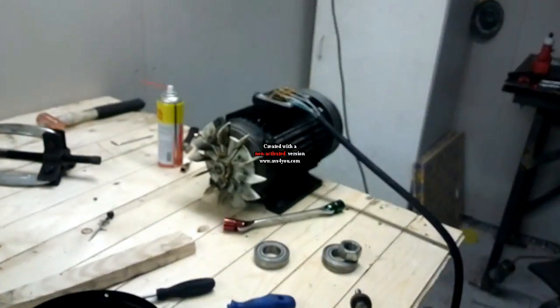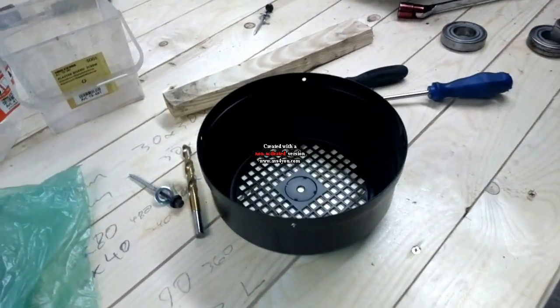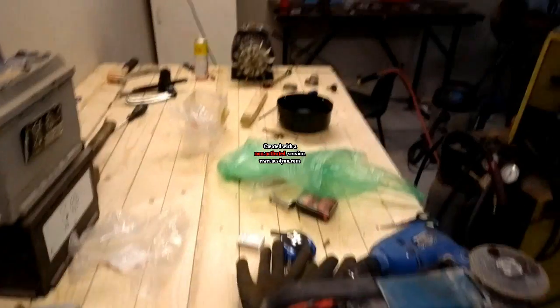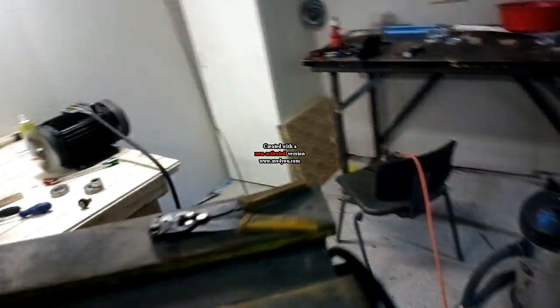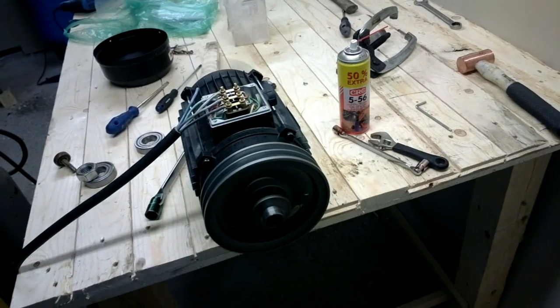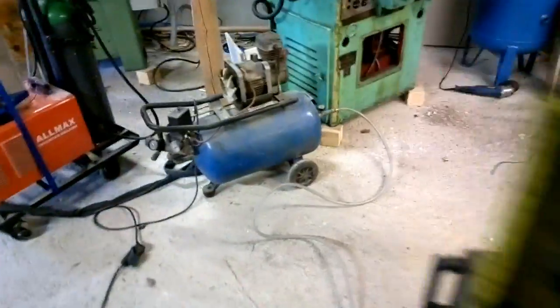Time for a trial run. I have the fan back on, but I didn't put the cover back on yet because I can't reach right here with the motor still attached to the table. That's going to be possible to attach only when the motor is off the table. Maybe you remember what the motor sounded like before the bearing change — well, the fan is making a lot of sound, but there is absolutely no bearing sound now. Compared to the old bearing, this is extremely silent. I would call this a very successful repair.